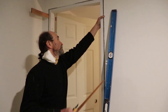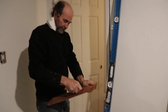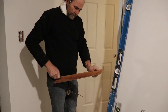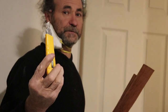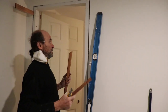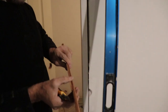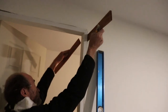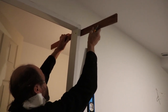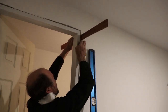I'm just gonna put the shim here just to fill in this gap. I don't need it this wide so I'm just gonna split this guy in half. I'm just gonna use a utility knife to cut it - nothing too crazy, you can use a saw too. I'll show you guys how you do the shim. We're gonna have one on each side and then we're gonna push them until they are tight. That's how we do it - one from each side and then we just push it in. Just bang on it a little bit, not too much.